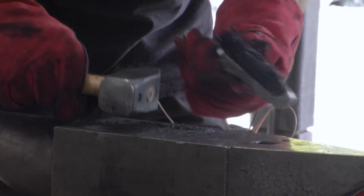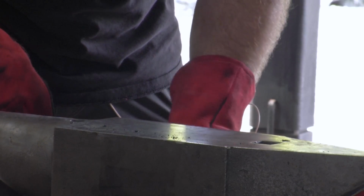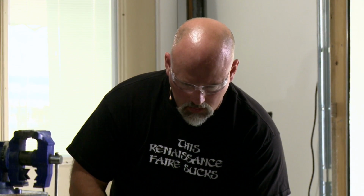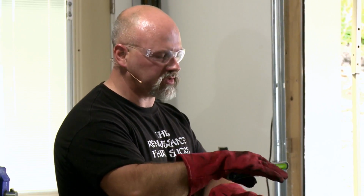That's shattered. Yeah. Do you use a sacrificial plate in the furnace to prevent damage from the flux to the insulation? Yeah. There's actually two ceramic shelves in there, and occasionally you throw away the top ceramic shelf when it gets all gooey and gross like mine's getting.